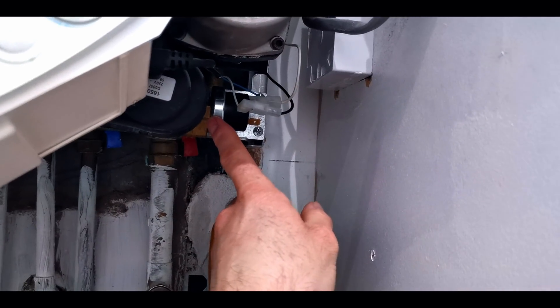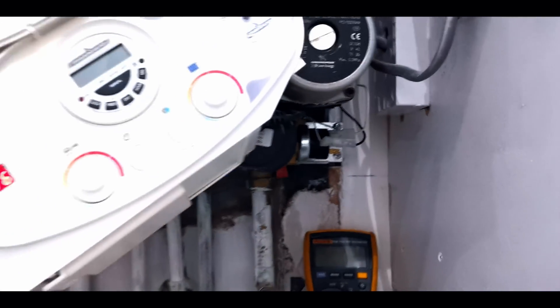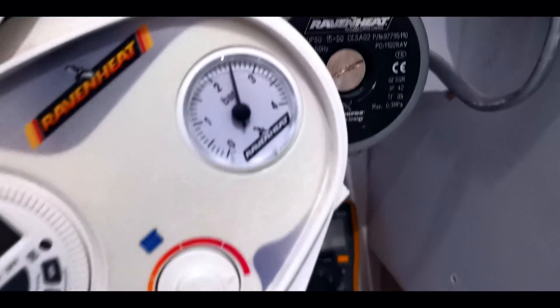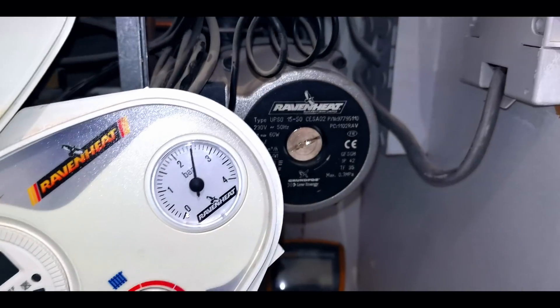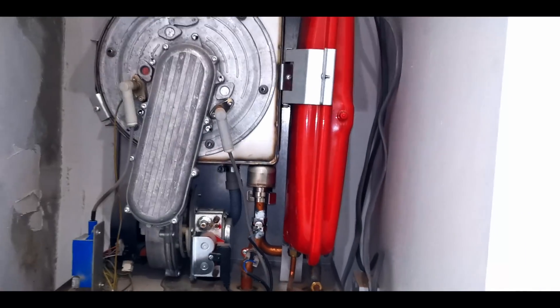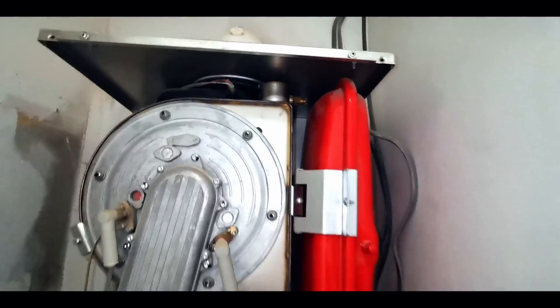So what happened was an engineer came and replaced the pump, because it had stopped working as far as I'm aware. What I think happened is when he replaced it, he introduced a lot of air into the system or into the boiler, which is what we could hear when it was first trying to run. Pressure differential switches don't like air. Any bit of air can cause it not to sense, because the air acts as an absorption - it absorbs the pressure from the pump, so a pressure differential switch won't see it. Let me deal with this pressure issue, which as any engineer will know is quite a basic thing. I'm going to get on with that and then retest the boiler. When I refill this boiler after dealing with that issue, I'm going to vent the air out of there.